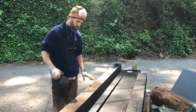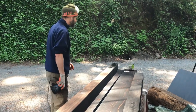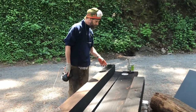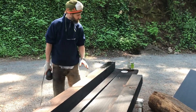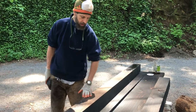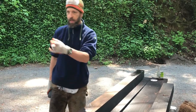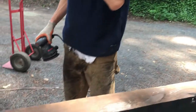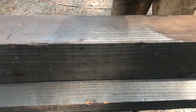We're lightly sanding it with a 60 grit orbital. This little section I painted with linseed oil — it's not going to look great yet, but after it dries it'll create a nice sheen, giving it a patina or rustic look. This section here is not sanded, and this one is sanded, so it's a pretty light treatment.